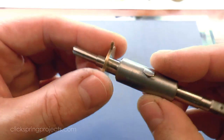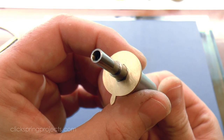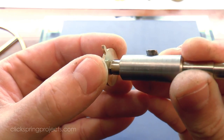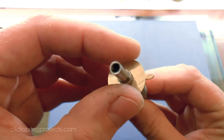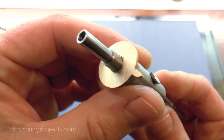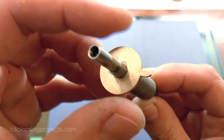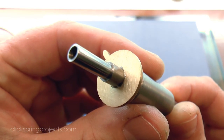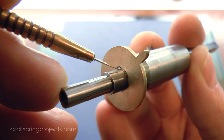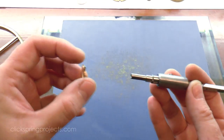Importantly, the wheel now fits comfortably in all positions around the arbor hex. It's a snug fit, but not so tight that it can't be gently lifted off the arbor when setting the stop work. The design calls for a clock pin to sit in front of the wheel and hold it in place, so it's back to the mill to drop in a small cross hole.